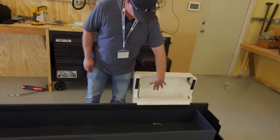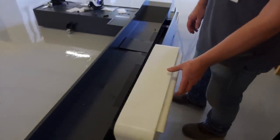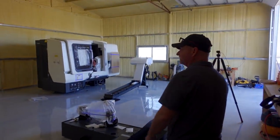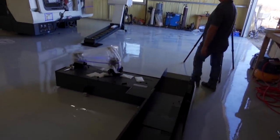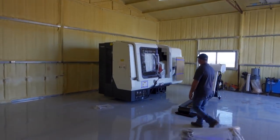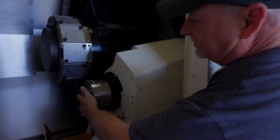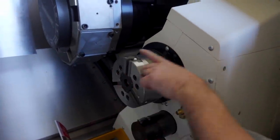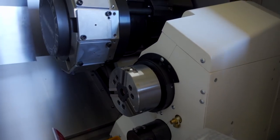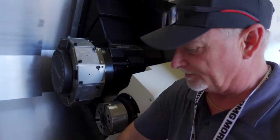It's got a parts catcher. So how does that happen — they go in there? Yeah, it'll kick it off into here and just open this door — you just open it and there they are. So you don't even have to open the door. Oh nice. So this is a parts catcher. The parts are done, it's gonna spit them into here, and then I'll be able to just open this thing, get all the parts out. The machine keeps running. You were asking if the machine had a push rod — it's right here. So whenever you get down on the sub spindle, there's a hydraulic cylinder back in there. It pushes the part out into this arm. If the arm sits up underneath here, it pushes the part out and rolls it over into the parts catcher, then the arm stays out of the way.